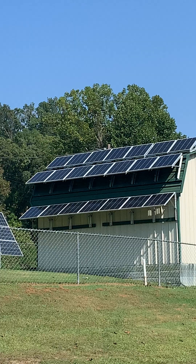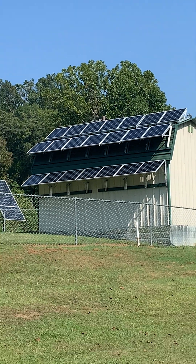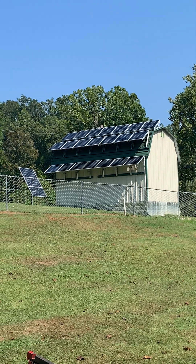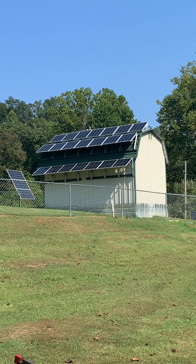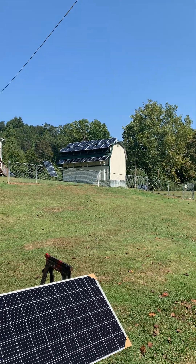Right there is my 700-watt strands. Got three of them. That top one right there is hooked to my Mega 5 in the house. And the 700-watts, I just checked it — it's bringing 360, 365-watts into my Mega 5. Like I said, it's just really hazy today.